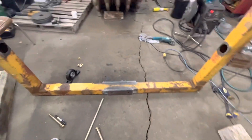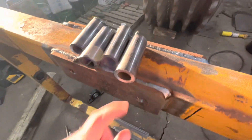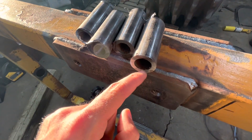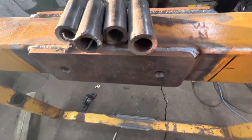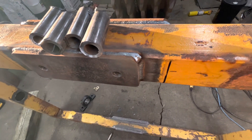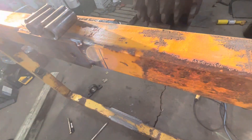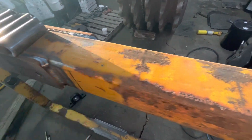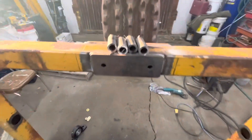Another thing I did is on the frame — I got these welded on. So what I did was take this quarter inch wall tubing, inch and a half outside diameter, one inch inside diameter. My 13/16ths bolts can fit through. But now I have that rigid piece of pipe inside in the middle where they're squishing down, and now I can tighten those bolts as much as I want and it's not going to compress this. Same with when the bearing tries to pull — if the drum gets banged up in the mud, it won't try and squish it down because it's got that piece of pipe in there. So what I did was just take the plasma cutter, cut an inch and a half hole, slip that in, welded it around the top, and ground it down flat. So now I got those four cut out for the other side.